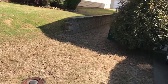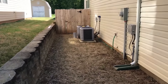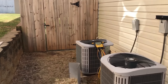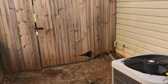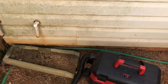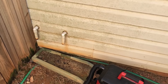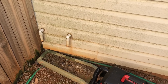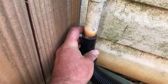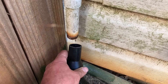I did get up in the attic — I just thought I better see what's going on here. We do indeed have a drain pan about half full of water. I don't know if it drained out or what it did, but we're going to check the primary and get some of that water out and hang around and wait on it to make water. This thing's not real super powerful but sometimes it will.